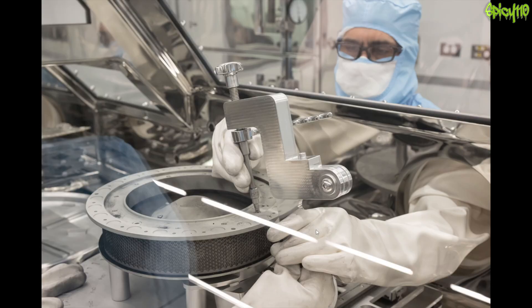This is the tool they came up with. I heard they needed to make a specialist tool, so I was really interested to see what it was. And there it is — and it's amazingly simple and clever at the same time. The reason why it's so overly engineered and the machining looks so rough is because this had to be made out of stainless steel. Everything made of stainless steel. It has to be cleaned, it has to be of known properties before it can be put in the bags and into the sealed environment with the sample, which is why it took them a few months to get from stuck screw to actually getting it undone.